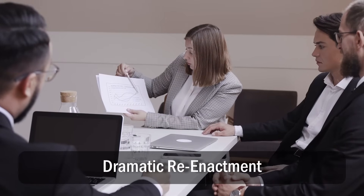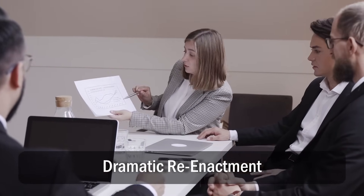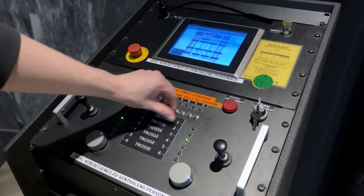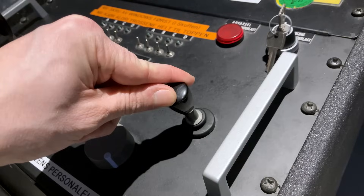The weight that can be hung is calculated beforehand between the riggers and someone at the venue with the appropriate data. Once these winch chains are attached to the venue, they're connected to a power supply on the ground with a remote control that lets you steer each individual chain — allowing you to raise one side of the PA or the other. There are also manual chain winches where you pull on a chain to hoist the PA. It's pretty intense work, and after about six or seven meters it gets tough on your arms.